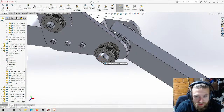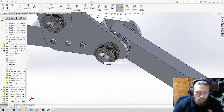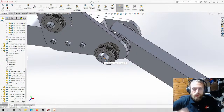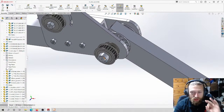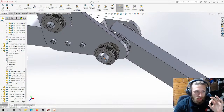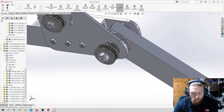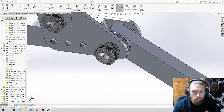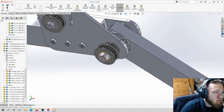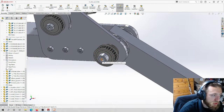I can't do it on the CNC. I could cut it, but it comes in big pieces of stock. I could cut it down to size. It comes as the extruded half-inch hex, and then we cut it to size, put it on the lathe, and machine it down to exact dimensions. I couldn't just cut this to size because I have to put these holes in it.